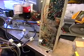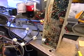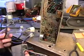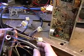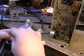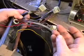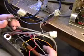We're going to discuss installing the 140B LED mod, and this requires some modification of the chassis as well as the control unit. This is the control unit, and this is an old one. If you buy a new harness from us, the wires will already be in there, and these two leads here, and they might be a slightly different color in your unit, went to the neon lamp down there. And we're going to convert this to LED.